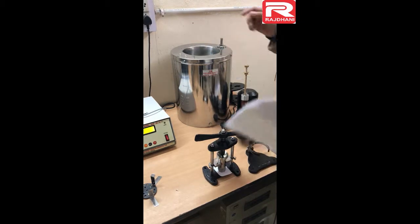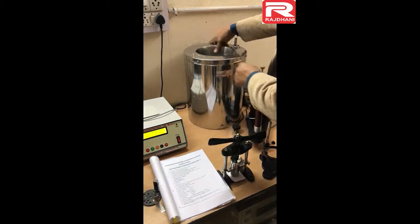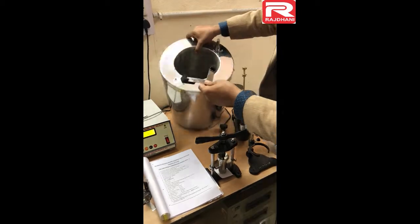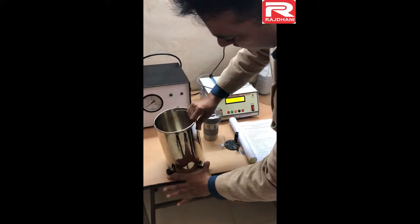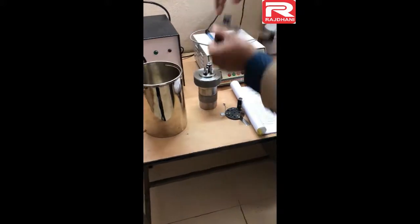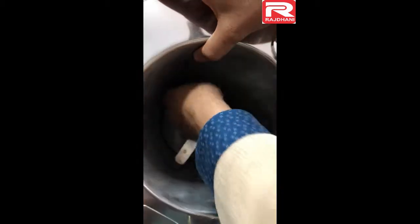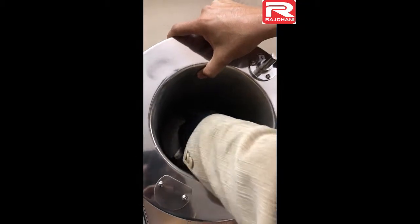So our second part was the puff insulated outer jacket with calorimeter vessel support. This is the calorimeter vessel, and inside this is the calorimeter vessel support. This calorimeter vessel support is fitted inside the jacket — it sits like this. In this jacket you can see there is a welding piece; in that welding piece one leg goes inside a U-shaped welding piece and this leg gets fitted inside so that it will not move. So this is the calorimeter vessel stand.